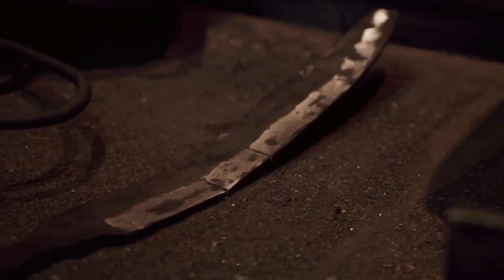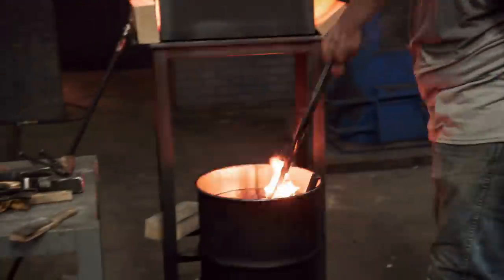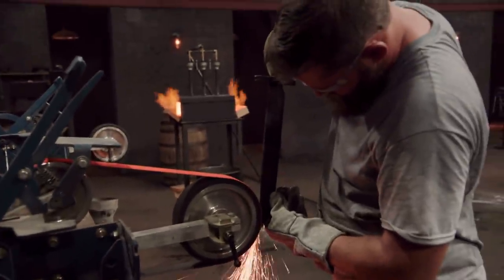That just shattered like glass when I hardened it. 30 minutes! The second blade isn't nearly as refined as the first one. But if I can get this thing quenched and get to the grinder for at least three or four minutes, I feel like I might have a chance to make it through the second round. It's not as hard as I want it to be, but not every tool steel is as hard as a file. So we're moving on to the grinder.